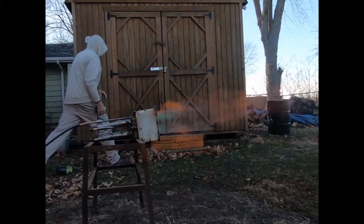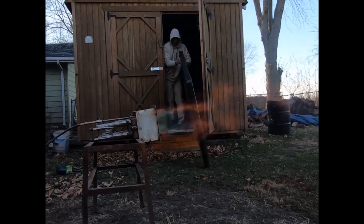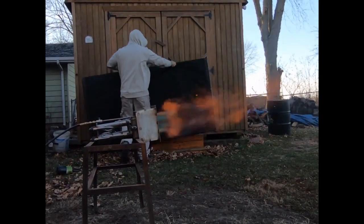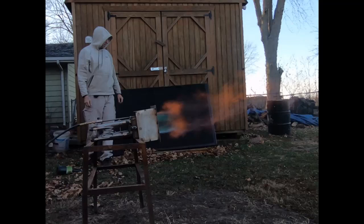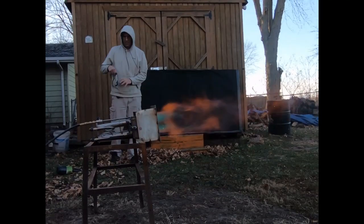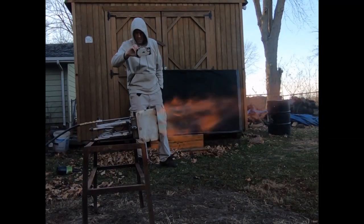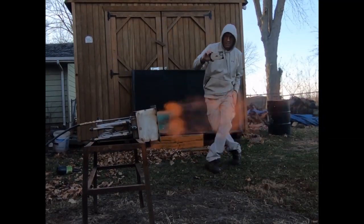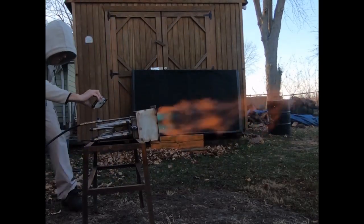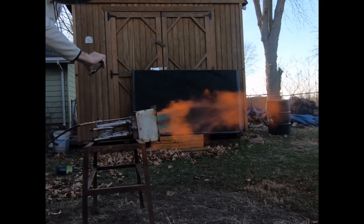This thing's going to be hooked up to a pretty big LP supply, so I don't think we've got anything to worry about on that end. It isn't meant to be efficient — it's meant to take the place of a bunch of coal that was initially heating the bricks in the brick kiln. It does have a strange buffeting to it, but I don't think it's a problem. Just moving those barrels about 5 millimeters forward has definitely caused a difference in functionality — it runs way better at lower settings now.